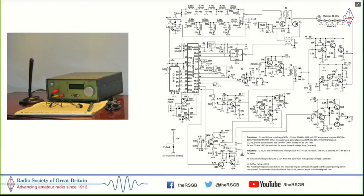And the other important thing here, which I used, was that these IF amplifiers were designed by Wes Hayward specifically for the BitX radios. And they used not one, but three transistors each. And the remaining two transistors did an amazing thing, that they transformed the 220 ohms into a 50 ohms output impedance. And the best part about this amplifier block was that the input impedance and the output impedance were independent of each other. So the output termination did not change the input termination, and the input termination did not affect the output termination, which is otherwise the case with feedback amplifiers.